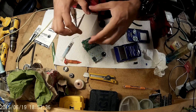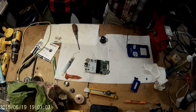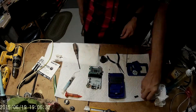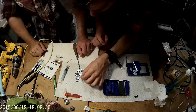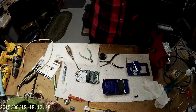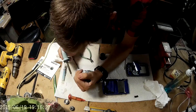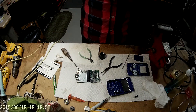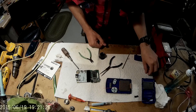I'm going to continue going and keep the camera rolling. I've got my father, who is an electrical engineer, helping me out trying to decide how to wire it up - what resistor to use, what trim pot to use. A trim pot is short for trimmer potentiometer, which is basically a variable resistor just a lot smaller. I wound up using a 47 ohm resistor in series with a 200 ohm trim pot. I used them in series together because if you turn the trim pot all the way down you never want it to approach zero ohms, as it will short out or draw too much current.